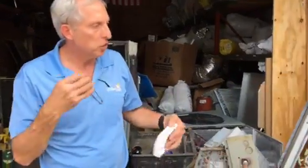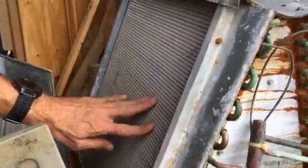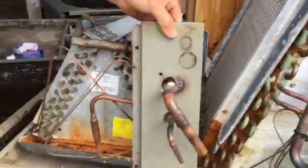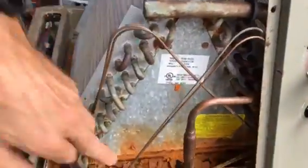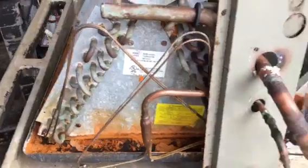What I want to talk about today is what it takes to replace an indoor coil and why we have to replace them — sometimes after four, five, or six years. If you look at this particular coil, you've got three dissimilar metals: copper, aluminum, and tin. The same applies here. This one is actually sitting in water, and it's called excessive corrosion. What causes this is what we call formic acid — a chemical reaction of oxygen, water, and these dissimilar metals that just corrodes and breaks things down.